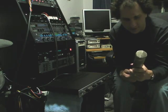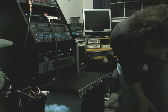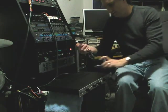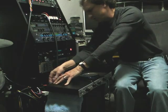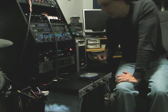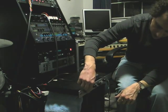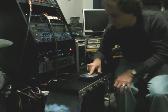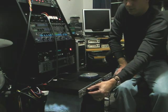The last test I am going to do is demonstrate the line input. I am using a CD player. The nice thing about these input jacks is that they are Neutrik combo jacks, so they can accept both an XLR input and a standard TRS quarter-inch input. I will use this on channel 1 first, put the gain all the way down, engage the line switch, and turn it on. We should start to hear some signal once it starts playing — and you can hear it coming now.